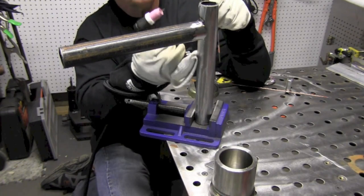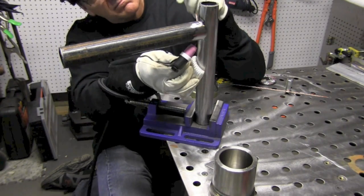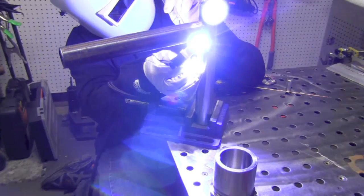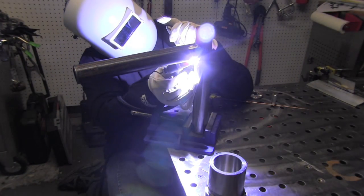Now we're going to come under the bottom. I'm kind of taking a few dry runs, and I've got the torch gripped up on the narrow part of the neck. I'm going to twist the torch as I go up because my torch angle is going to need to change. Otherwise I'm going to get way too much angle if I don't twist the torch as I go to adapt. That's the difficult part about welding tubing or pipe — maintaining the right angle because it gradually changes every time you dip rod.